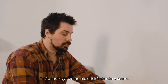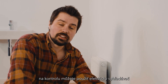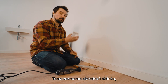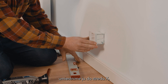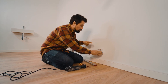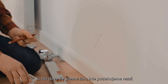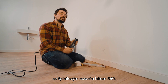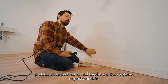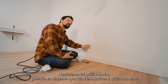Now we're going to cut out an electrical box in the wall. I've marked an X already where the wires are. If you don't know where the wires are, you can use an electrical finder to check, and also use a stud finder to check that you're not going into the stud work. I've switched off the electrical circuit so it's all safe to go. Now we take the electrical box and place it in the middle of the X. We use a level to make sure it's perfectly square, then take a pencil and trace around the box — that leaves us exactly where we need to cut. We're using the multi-purpose cutting kit with a 560 spiral cutting bit. It has non-sharp edges, which is brilliant because if we do touch any wires in the wall it won't damage the wire. I'm going to set the depth to 15 millimetres because the plasterboard is nine and a half millimetres — we don't want to go too deep to avoid any wires behind there.